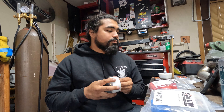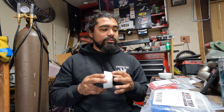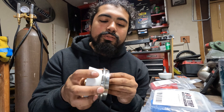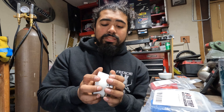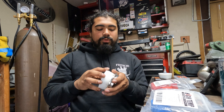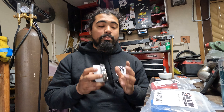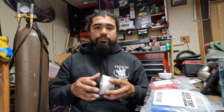A couple of purge bungs - they still withstand a good amount of heat. I kind of melted this one right here because I wanted to test how heat resistant they are. I put this inside a V-band - I was welding a hood dump for a civic. I put this very close to the V-band and there's not much space inside there, so my weld is going right there. I had my argon flowing and the amps turned up to get nice penetration on a thick flange. This was getting a good amount of heat so it did start to smoke and caught on fire on the inside. When I pulled it off the silicone was actually dripping on fire, but it wasn't much. It's kind of hard to weld very very close to it like near a flange, but for everything else it works very very well. I still got a nice back purge full penetration - I just sacrificed a little bit of the silicone, which is no big deal.